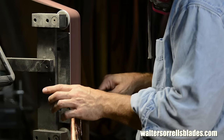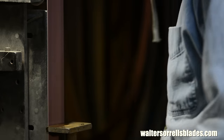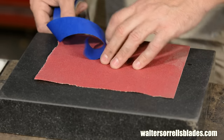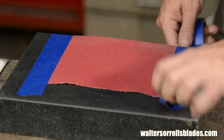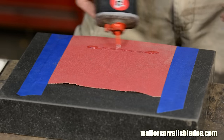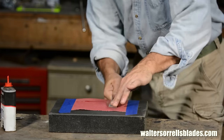Removing the scale is not exactly the same as flattening the steel. Depending on what level of finish you're aiming for, you may want to go ahead and flatten the steel too. If you remove the scale through grinding, you've also flattened it more or less. If not, you can use sandpaper — just tape 80 or 120 grit sandpaper to a piece of glass. Apply elbow grease and sand back and forth until you've removed all the dimples or tool marks in the steel. Nice and flat. You should be able to do this in about 20 minutes.